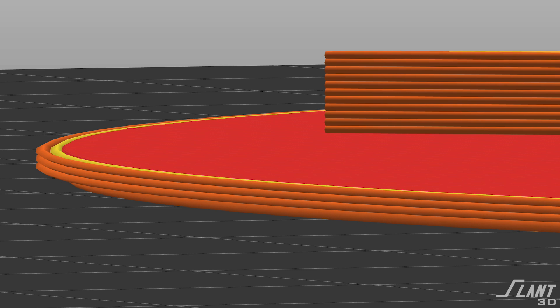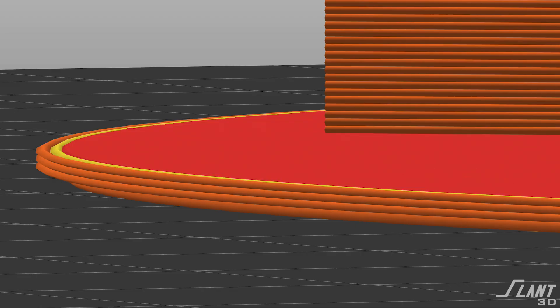You do not want to make it thicker. If you make it thicker it's now more than one layer thick inside of the print profile, and if you upload it to a system like ours it would definitely be a couple layers thick if you made it like one millimeter. At that point it is no longer a brim to be removed — that is a feature that is part of the part and we're not going to touch it. So just make sure it's very thin.